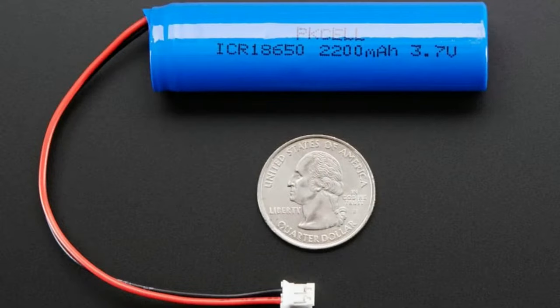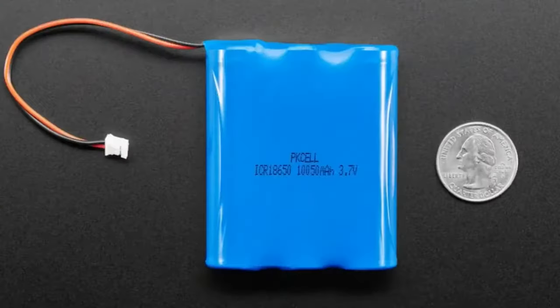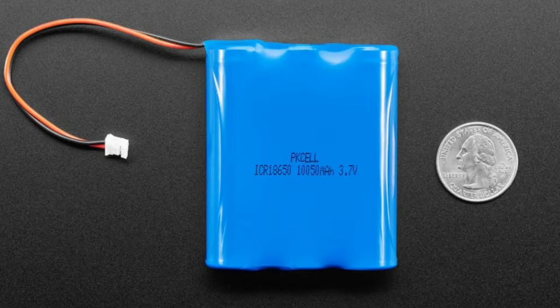Instead, you use lithium ion battery cells — like this standard 18650 cell with a blue plastic coating, often made by companies like Panasonic and Sony. When we visited Panasonic with Digi-Key, they mentioned a huge amount of their business is selling electric vehicle batteries. You can put these in packs — this parallel pack has three cells connected in parallel to give larger capacity at the same voltage. In an EV, you'll have strings of batteries serialized to give about 48 volts, then those strings are parallelized to give a lot of current. The battery packs are just enormous.